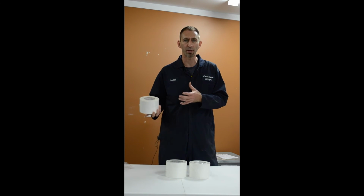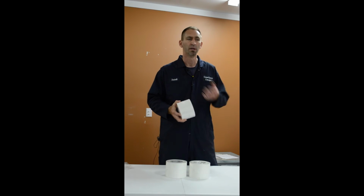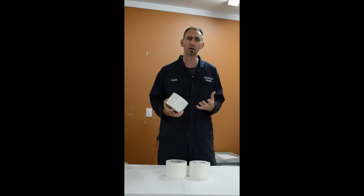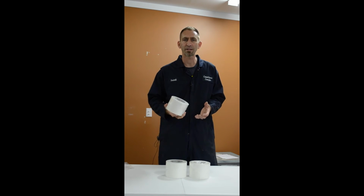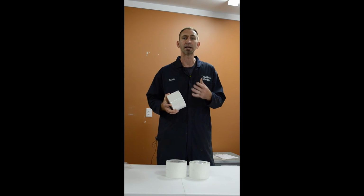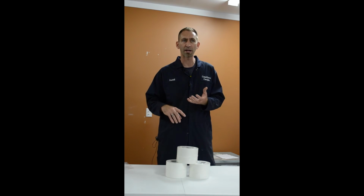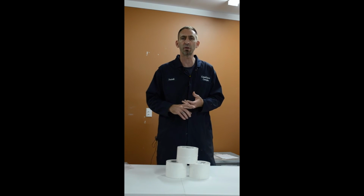The plastic's one temperature outdoors, and you bring it into the crawl space, it's a cooler temperature, you're breathing, you're sweating, and it's going to cause condensation. It's not going to stick to dirt, and it's not going to stick to moisture. So these seams need to be dry and clean. And keeping a brush or a vacuum or a rag with you as you go along to tape it is going to be ideal.